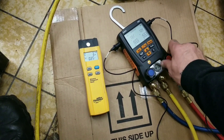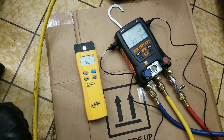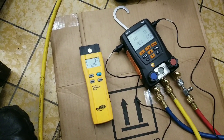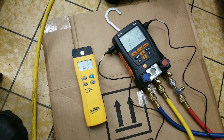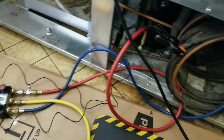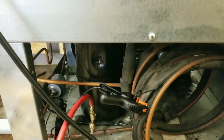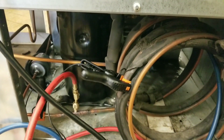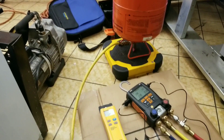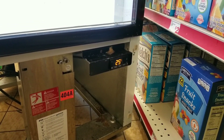All right, we're just about 3 pounds 6 ounces. Now I did have to dump a bunch of that into my suction side, which means I probably have liquid sitting on my compressor or near it. So I'm going to let that settle, let the system sort of equalize before I turn it on. But in the meantime I can get some of this stuff packed up. Went from 77 to 25 now.